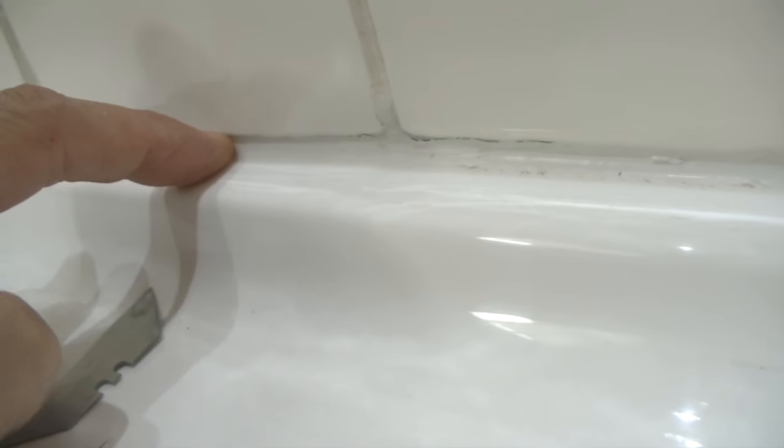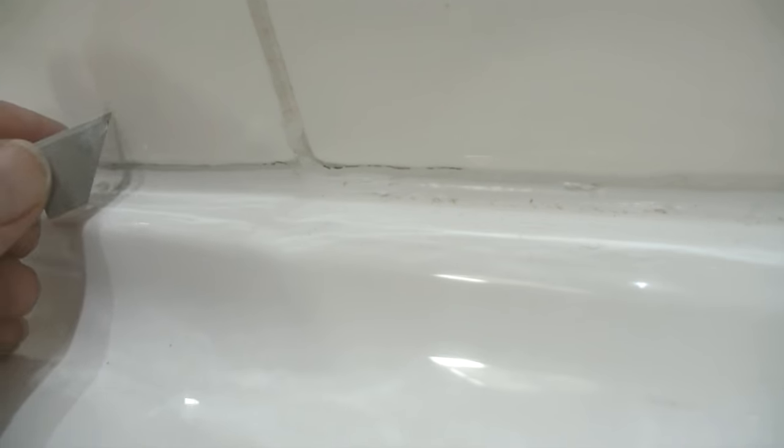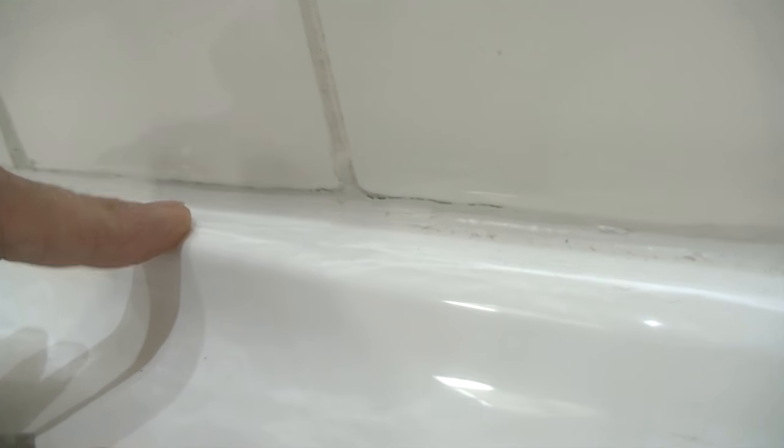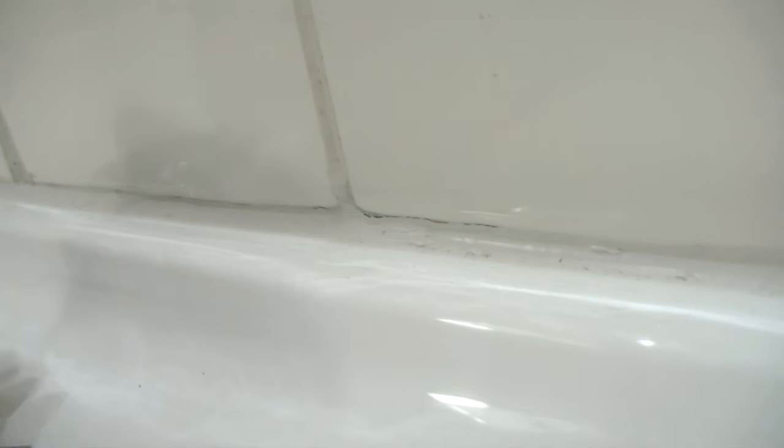However, if, like in my bathroom, you've got pretty clean joints where the silicone has been piped into a gap between the tile and the shower tray so it's not really proud of the surface, and you can get a bead on top of it pretty well, I wouldn't worry too much about removing the silicone. I'm not going to be able to remove this silicone partly because I've got an acrylic shower tray, so it would damage it if I start scraping. But also because the silicone has been piped so well into the joint, it's not necessary to remove it.